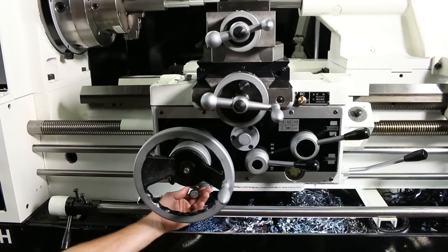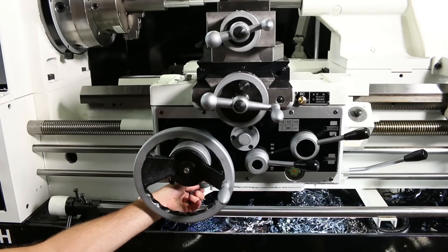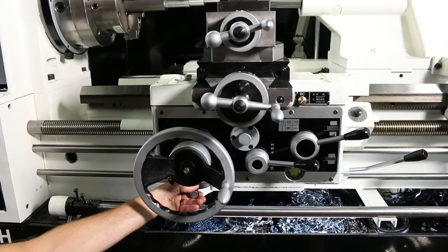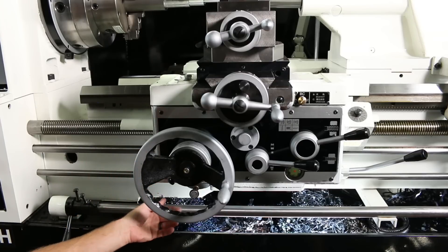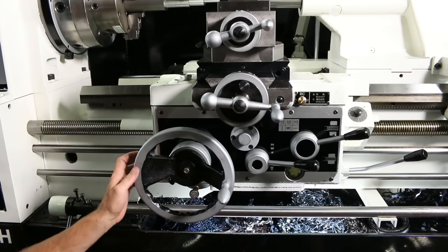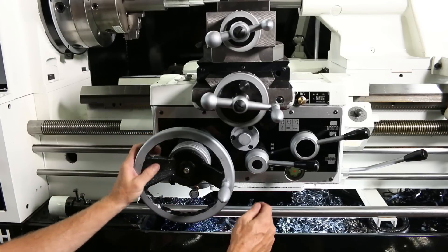Here's your lubrication — this on/off is your lubrication for your cross slide and your longitude. LeBlanc recommends that you keep it at an eighth so you don't flood your whole system and lose all your oil, having to refill every day. If you keep it at an eighth, it's plenty of lubrication for an eight-hour shift.